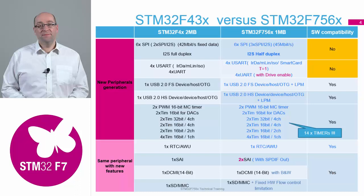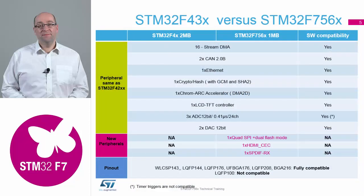Nothing changes in USB. We've added a new feature into the high-speed USB, but it doesn't impact any of the software compatibility. Timers are exactly the same — we've gained a new timer, which I'll show a bit later on in the slides. RTC is the same. Camera module, SAI, and external SD card have stayed the same, so no changes to any software previously written for those elements. The same goes for most of the complex peripherals as well — we've not changed any of them at all, and your software is 100% compatible.